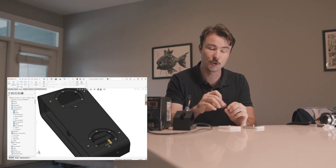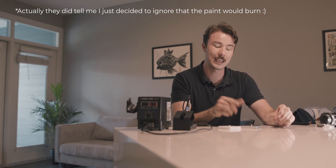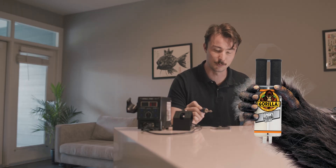When I was designing the speaker, I was relying really heavily on these threaded inserts, which allow you to use a soldering iron to push them into a hole in the 3D print, and then you can bolt in whatever you need. Unfortunately, I didn't realize PCBWay would spray paint the plastic. Here's how it should be with a standard 3D print — no smoke, it goes in nicely, and you can put a bolt in there and it stays. Here's the same thing spray painted — not so great. So I ended up drilling out all the holes and using epoxy instead, which wasn't as strong but got the job done.